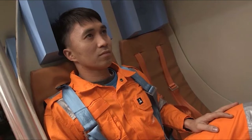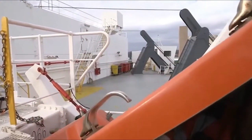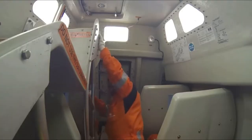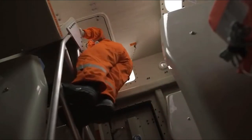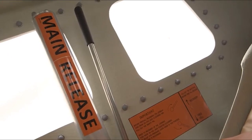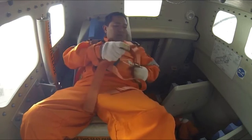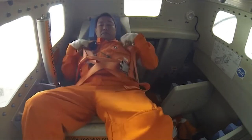Don't curl up. Your seat has been specifically designed to protect you from the impact with the water. With everyone aboard, the coxswain secures the door and proceeds to his own seat and straps in. The coxswain will be responsible for operating the primary release mechanism, positioned by their seat. The coxswain then checks that everyone is safe and secured. If they are, the lifeboat is ready to launch.